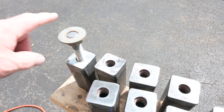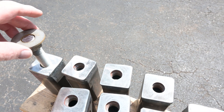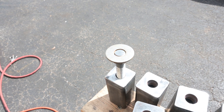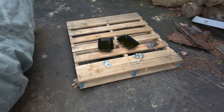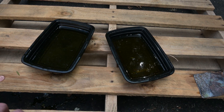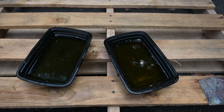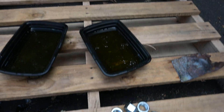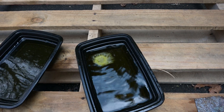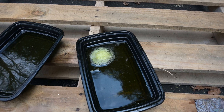All I have left now is to make the adjustable legs, but all the hardware I have is zinc coated, and zinc coating and TIG welding don't really mix too well. So what we're going to do is I've got a couple of buckets of muriatic acid over here, and I'm just going to put the hardware in — got the washers, the nuts. And if you watch, as you put the hardware in, it just starts bubbling instantly.